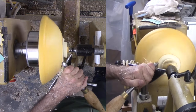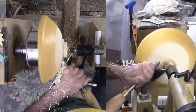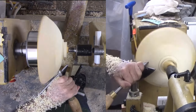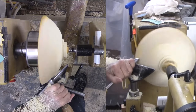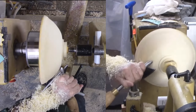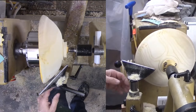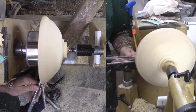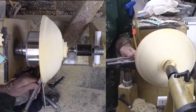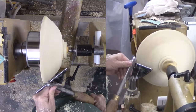While still mounted this way, I can start refining the exterior to take out the difference from the warp and work towards the final profile. For this, I often use a shear cut with my bowl gouge, cutting edge more vertical relative to the wood. This enables light cuts, removing a minimum of wood. But before going for a final profile, it helps to trim back the rim from the vertical warp. Then I can go for the final profile — I like a little flare at the rim. It signals fingers that the rim is near.